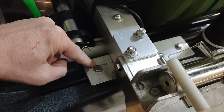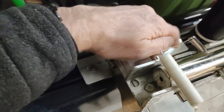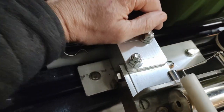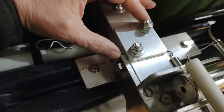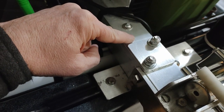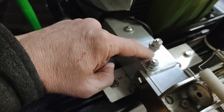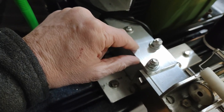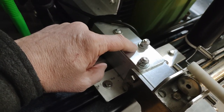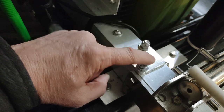So this plate here is 8 inches and it's got 3 bolts that are drilled into it and they go into the gear track. And then I have these 2 bolts, which are through bolted all the way through the spanner here. And then a 1/8 inch or 3/16 or 1/4 inch plate, I think. Yeah, 1/4 inch plate on top of that, bolted together.